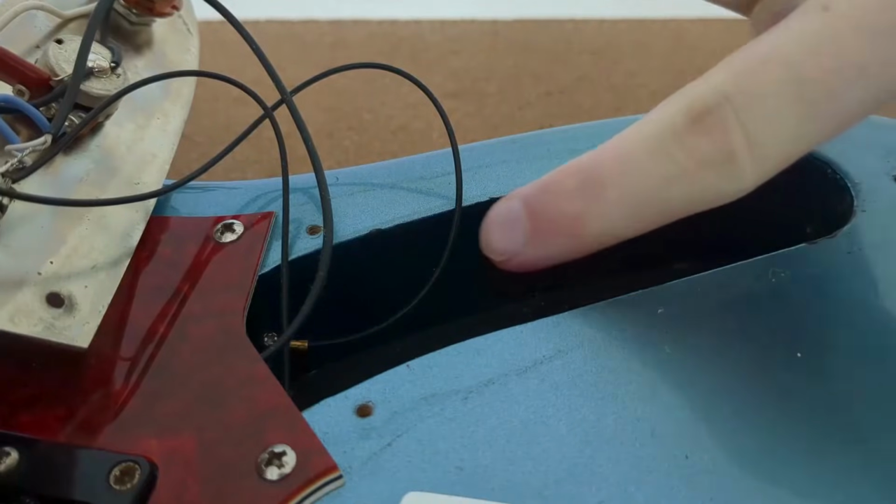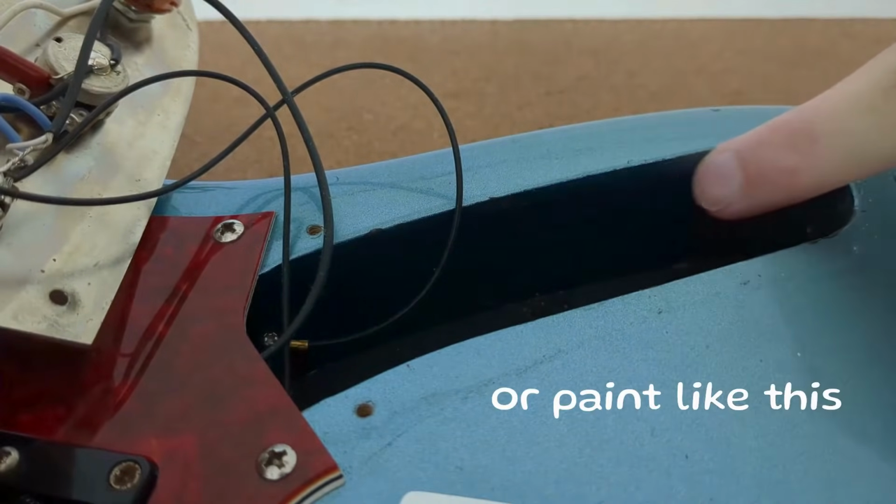If you want a more permanent solution, then you can actually shield your guitar's pickups against any stray electronic signals by putting a special conductive tape in the cavities. Failing that, you can always switch to humbucking pickups. And like the name suggests, these were designed to buck the hum, and it gives you a much less buzzy sound than single coil pickups do.